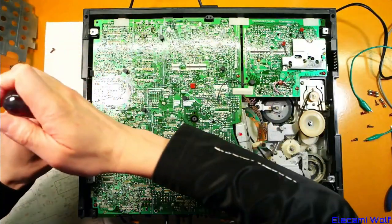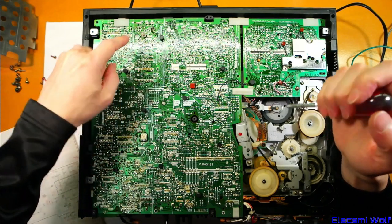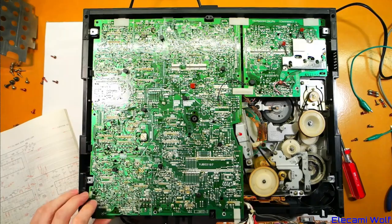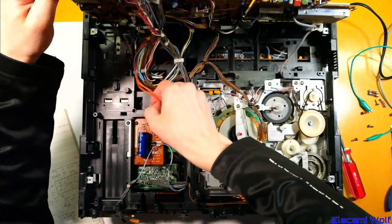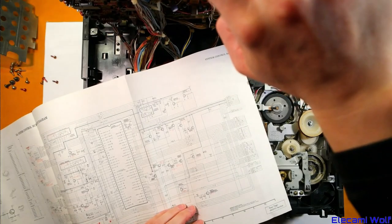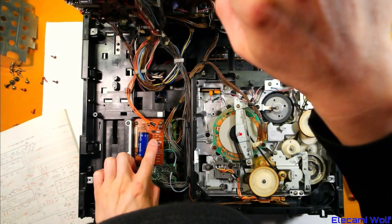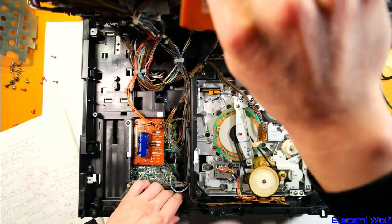There are hinges along the back there. There's audio — the normal non-HiFi audio and servo part, and the system control part here. There's a main IC there. This front board has to come up, there are clips, and then this will lift up. Now that board that I was poking about and thinking 'what is that?' — it's called subsystem control board code BOOC66. So that's a strange thing.